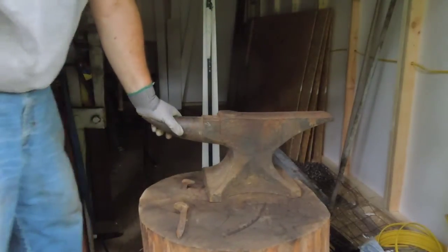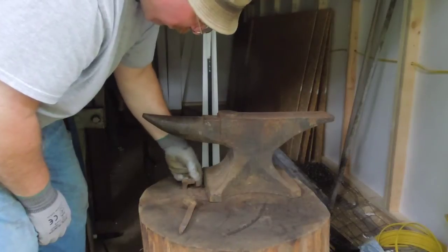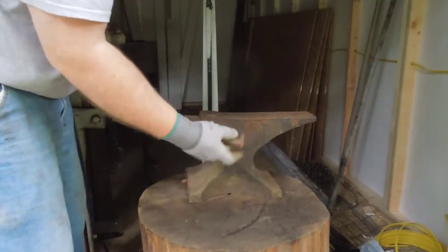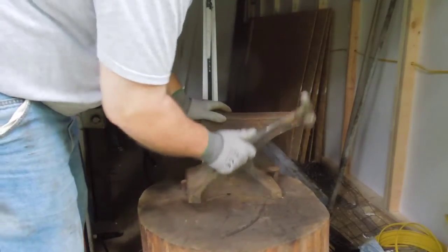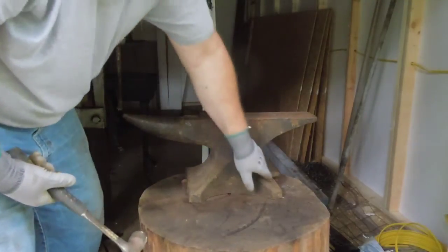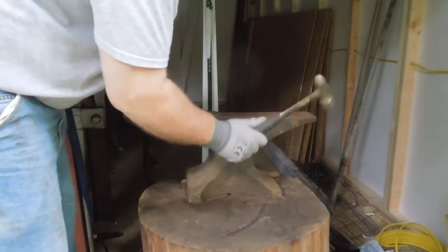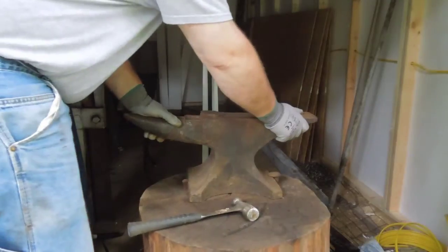The way I installed the anvil on top of the log was to forge down a railroad spike into a narrow pointed shape that fits into the hole in the front of the anvil — a nice snug, tapered wedge fit. I drilled a hole in the back that accepts another railroad spike. When I drive that spike in, because of the taper of the anvil and the taper of the bottom of the spike — very similar to how spikes connect to rails on a railroad track — as you tighten it down, it wedges like a holdfast and anchors the anvil into the log. Very solid.